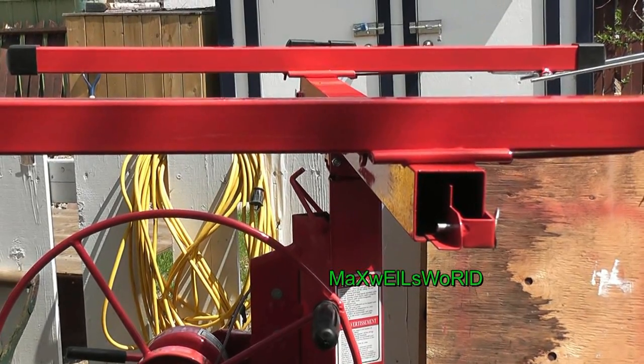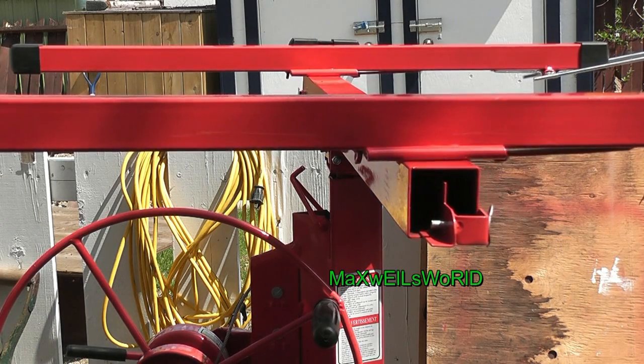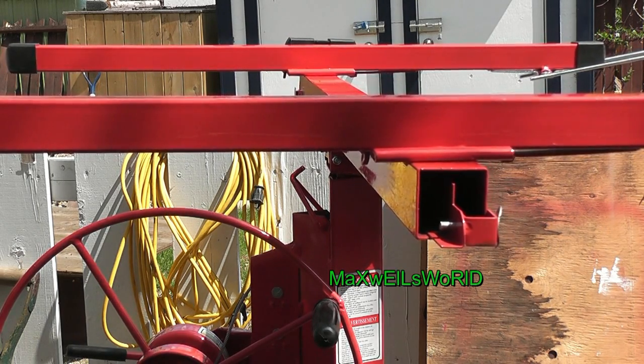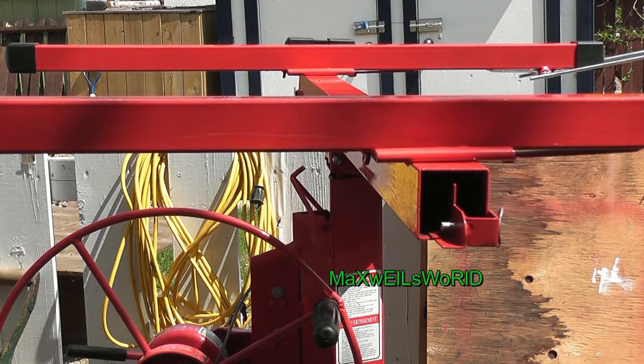So of course, once you've got these pieces all on, the next piece to install is the bracing. When you're running a longer sheet, longer than 8 feet or even 8 feet plus, you slide the outriggers out there to give the sheet extra hold. Because when you're running drywall, the longer the sheet, the more likely you are to snap it in half if you get it bouncing.